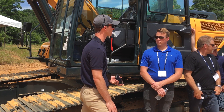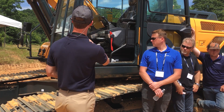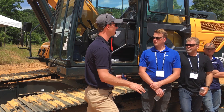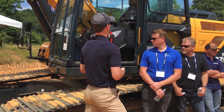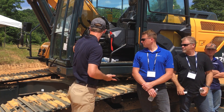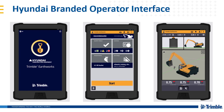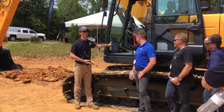Each one of those sensors is full 3D. The sensors are what we call 6-axis, outputting at 100 hertz — essentially 100 times a second — so they're extremely accurate and precise. On the display, when we first launch the application it shows Hyundai Construction Equipment Trimble Earthworks with your logo included. The colors are unique to Hyundai, so your customers ordering through the factory will have unique Hyundai branding, whereas other Trimble Earthworks users will have the generic aftermarket system.